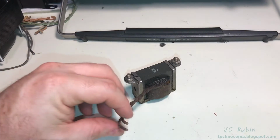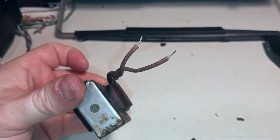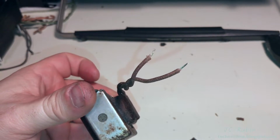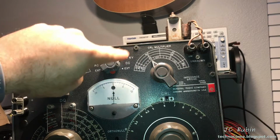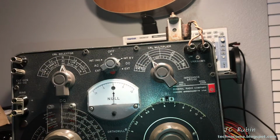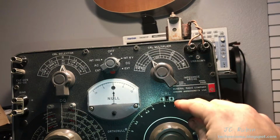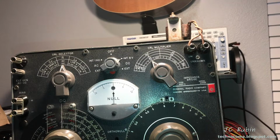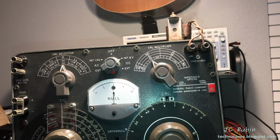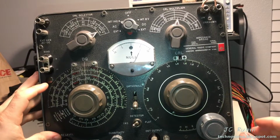So I'll cut back a small length of cable for testing. Now we will hook this up to the GenRad impedance bridge. We will take measurements off of this and compare it to the new one. See, the transformer is hooked up, or set, for resistance DC. Looking at the ×10, everything is perfectly balanced on the beam here. And you can see just right here, it comes right in the middle. It's 63 ohms. So that's what we're going to go with and write it down, and we'll see what we get on the next value. An interesting amount of trouble tuning this one.